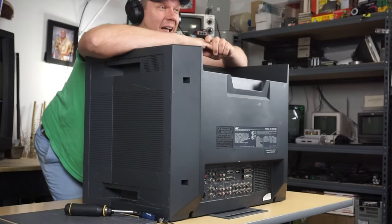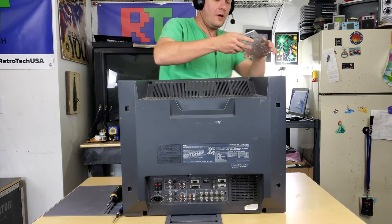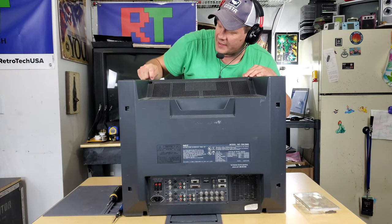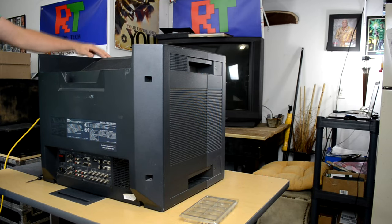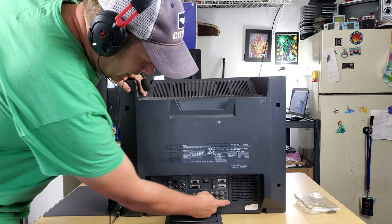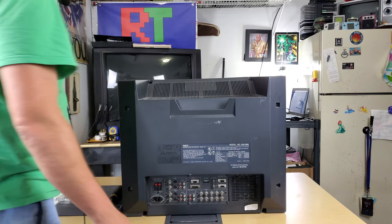Let's get a closer look at the back. I have removed five different Phillips head screws to this point — four on the back panel and one up at the top of the back. One screw up here won't come out; I think there might be a piece of broken plastic preventing it. You'll notice there are quite a few screws still down here at the input board — I've left those in place on purpose because there are two more screws we need to get out first.